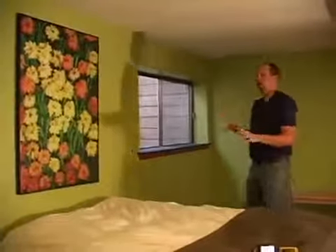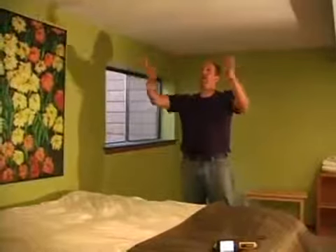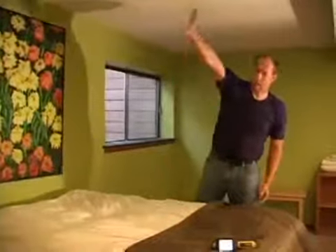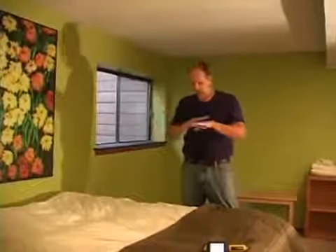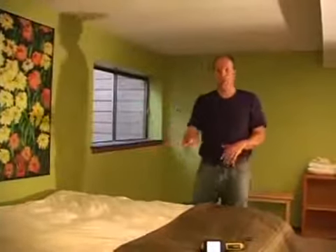When we came down we realized we're going to be partially underneath the deck. Above us, outside there's a deck — when you go out the rear slider door, you walk out onto a deck which is above this finished area right here, and it's not covered. So when you see an exterior deck that's not covered, it has a flat roof under it. You have to be concerned about what's underneath the deck — and it's this bedroom ceiling. So doing a visual inspection, you have to orient yourself and figure out the key areas where you want to inspect. This is the one critical area: underneath this deck.